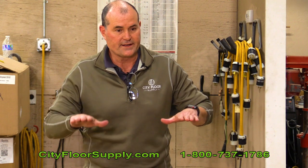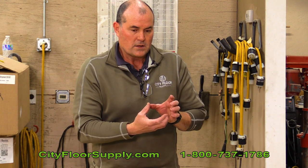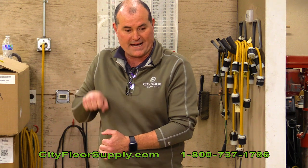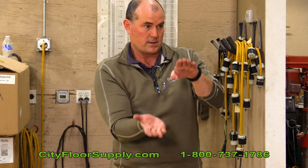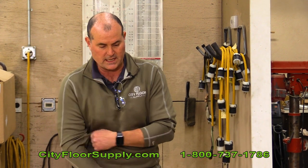The way the drum gets to the floor on the Galaxy is on two pivoting arms or pins, and it's a solid chassis. It's almost a carriage that goes from the rear caster all the way to the lateral casters, and the chassis itself sits in that carriage, and the pressure comes from a back spring. Whereas this unit sits over the carriage, the wheel truck, and gets lowered by pushing up against the spring. I don't know if that made sense, but that's the biggest difference between the two units when we're talking an 8-inch unit. The Legend's an 8-inch belt sander.